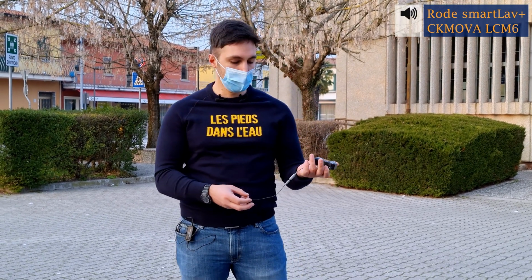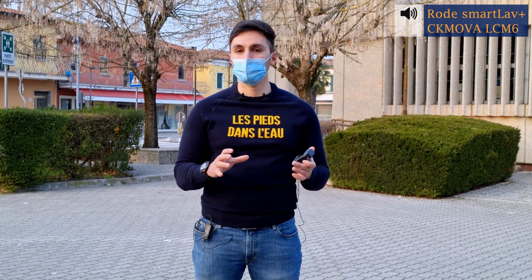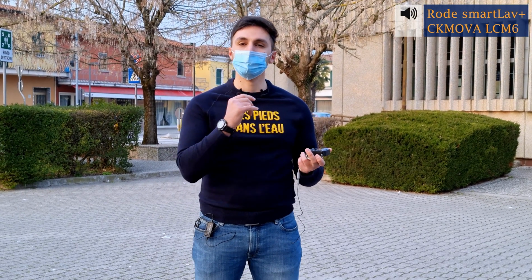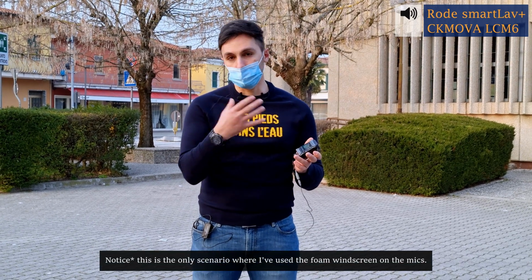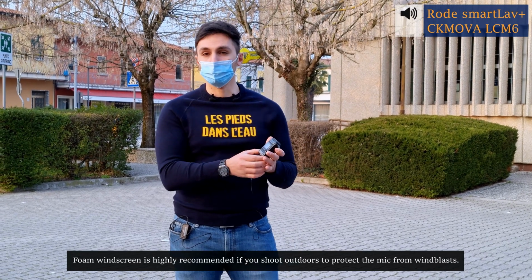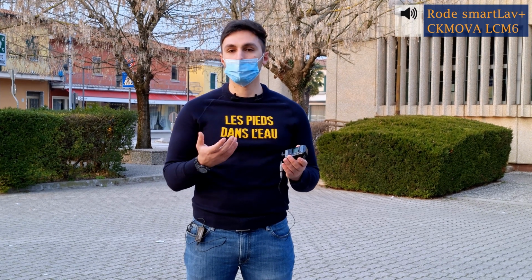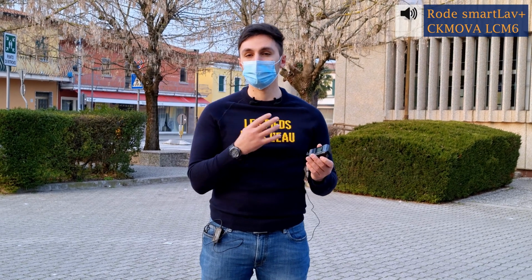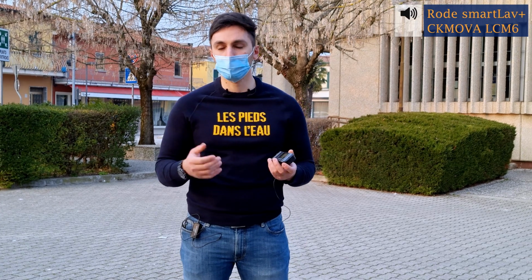So what about a Rode? What's good about a Rode? Well, many people rely on the brand itself. It's a Rode and it should be good. This mic was made to go straight to your smartphone, just plug, ready and go. If you want, however, to also adapt it to a camera or to an audio recorder, you need to buy this adapter that I have right here. I personally recommend and also prefer using an audio recorder, because they tend to have better preamps and hence deliver better audio quality.